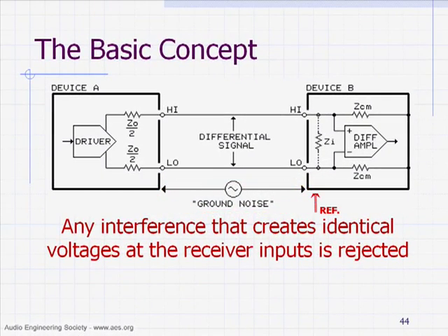Use the ground at the receiver as the reference point. With respect to this ground, that device that's driving the line — that may be 100 feet away — has voltage on it; it's moving with respect to the zero over here. Through the references to ground in the circuitry inside, even in the absence of a signal, both of these output pins will be moving up and down together at that same remote noise voltage.